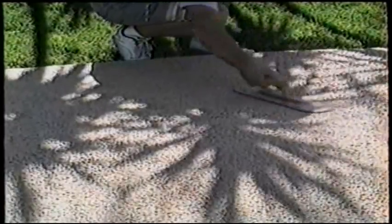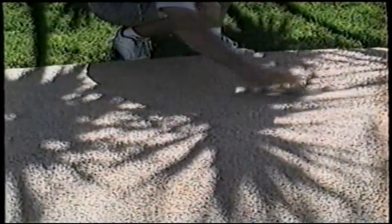If you miss it on an area that starts drying, you just take a little spray bottle, like you use for ironing, of water, and just spray some water on, or lightly mist it carefully with a water hose, just on the areas you need. That's why I recommend a spray bottle for that, so you can be more accurate, because you don't want to get water on areas that you're already waiting for. They're not quite ready to be troweled yet. But this one is drying out pretty evenly.